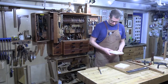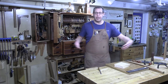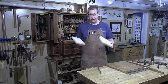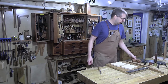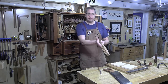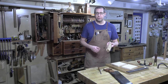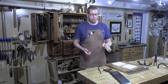I've got two pieces of scrap pine, probably about five inches long. Traditionally when you use a sliding dovetail, it's because you've got a wide board in a cross-grain situation, but for demonstration purposes I'm going to use a narrow piece. I'll need a cross-cut back saw, and I have a fence I've created with a 15-degree angle cut on one side — the same fence I use for all my sliding dovetails. I'm also going to use my router plane for cleaning out the floor of the socket. In this instance, the router plane is the most precise way to get a consistent floor.